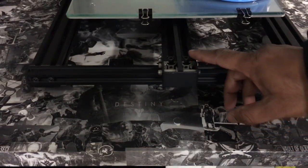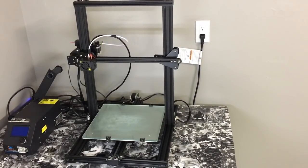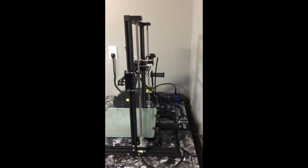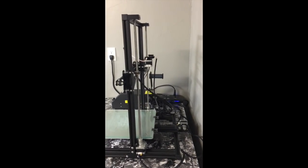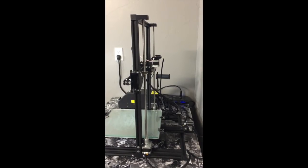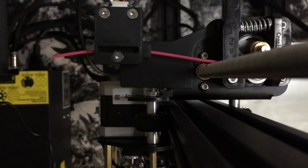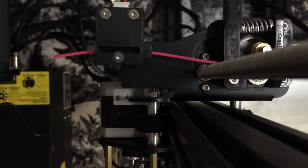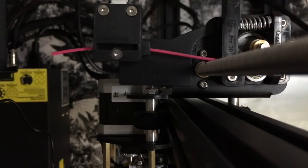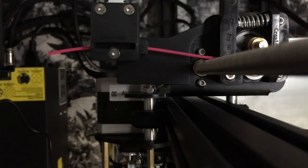One cool thing I really liked is the housing for the belt — this is an all-metal housing. Everything I've described so far is also included in the CR-10. What sets the S apart from the standard CR-10? One of the main differences is the dual Z-lead screws — one on the left and one on the right. What this does is ensure that your higher prints get the same consistent quality throughout. Another upgrade is the filament run-out sensor. When your filament is about to run out, once it goes through the sensor it stops the print, allowing you to change the filament so the print can continue from where you left off — unlike the CR-10, where it would just keep printing and ruin your whole print.